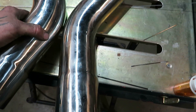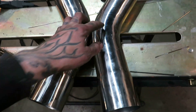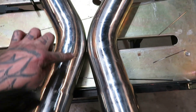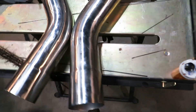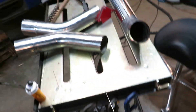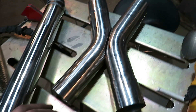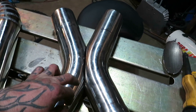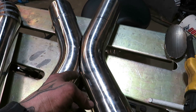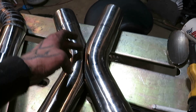So I cut this with a grinder. I'll probably cut them about so — straight shot there, straight shot there, then put them together and butt them up. That is the plan, we'll see how it plays out. So I took and just eyeballed up and drew a line across, drew a line across, then down and flipped it over each way and tried to mimic it.